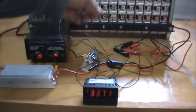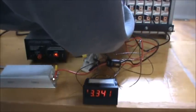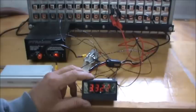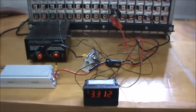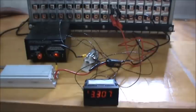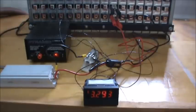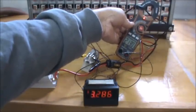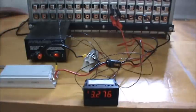The relay is currently engaged because we are above 2.8 volts. Now I'm going to take my clamps and connect them to my cell, and we are starting to pull current out of the cell. You can see the voltage is dropping. At around 3.3 volts it should be pulling about 20 amps — I'll check it with my clamp meter. It's reading 21.3 amps, and that will drop as the voltage drops.